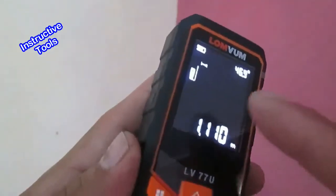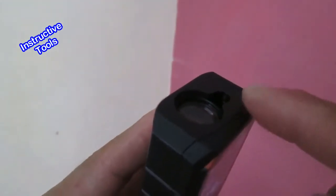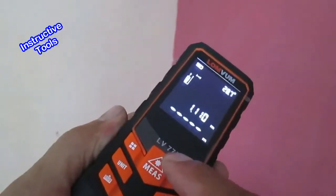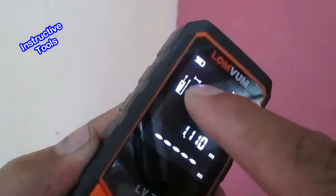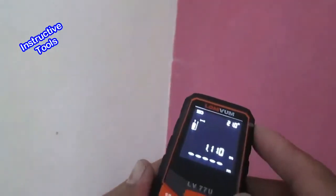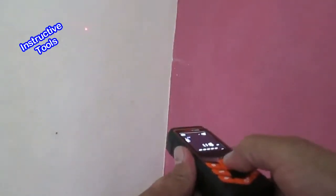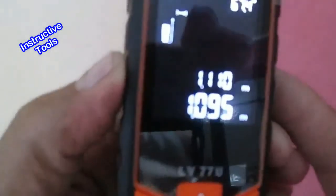When we do that, the laser light will be turned off. To turn it on, press the button again. Here we have opened a space — the symbol will turn on, indicating the laser light is on. Now we do the measurement: orient the instrument, press this button quickly, and there we have the distance measured.